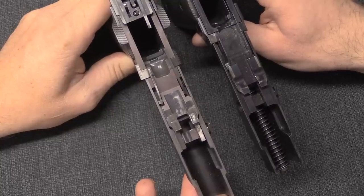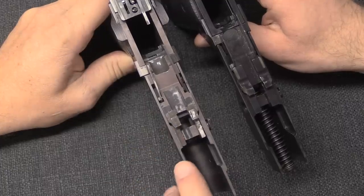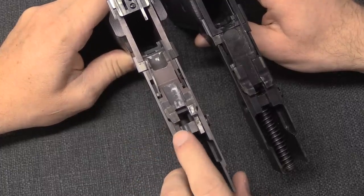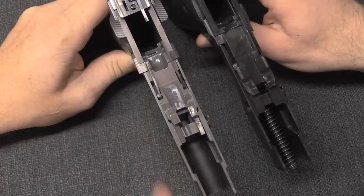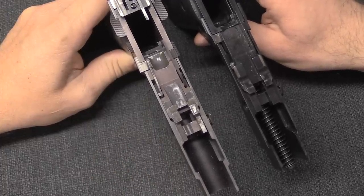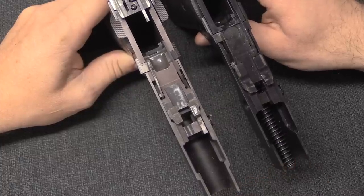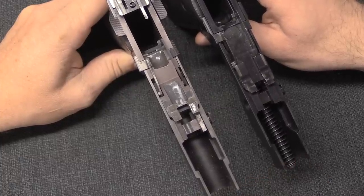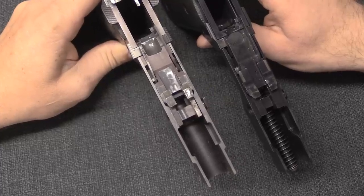That was very similar to the one we sent to Recoil Magazine. Whenever they did the review and broke it at 1,200 rounds, that was when we made the decision to just beef it up. And the next iteration, we got past our 10,000-round P-spec. Now we basically decided if we can make that as thick and bulky and beefy as possible, we should. If you compare the proof of concept to the production, it's almost doubled in thickness. This one now has a captive recoil spring.